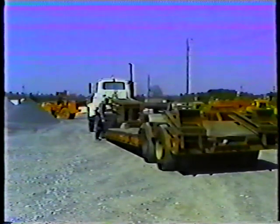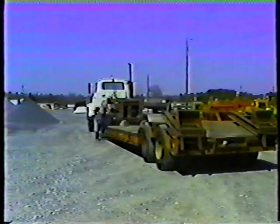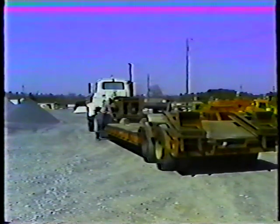This trailer has its own independent power source. The trailer motor operates a hydraulic ram that raises and lowers the gooseneck and with it the trailer. Some trailers do not have an independent power source; instead, the gooseneck and trailer are raised and lowered hydraulically from the tractor. This is called a wet line system.